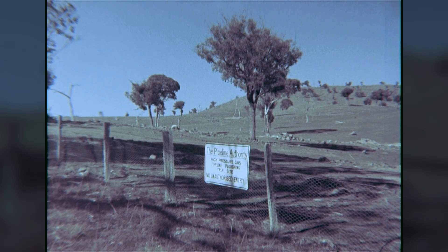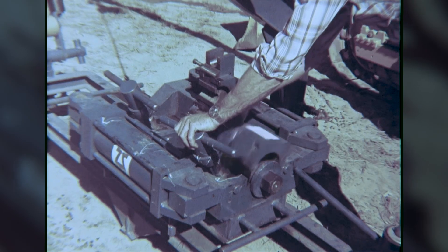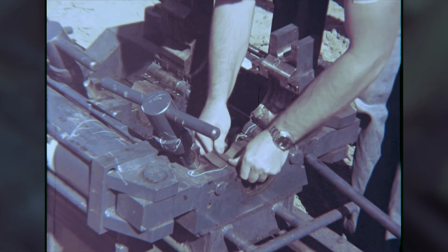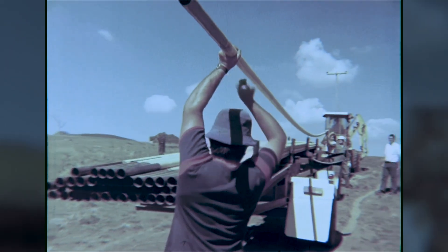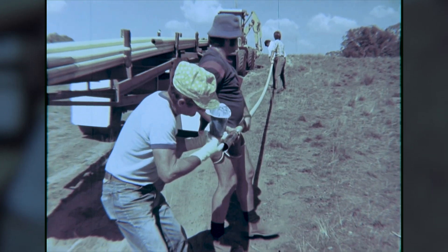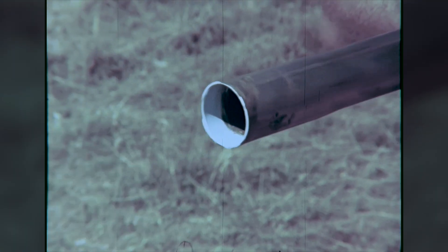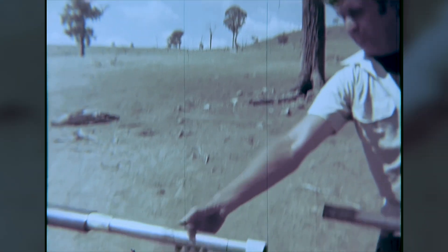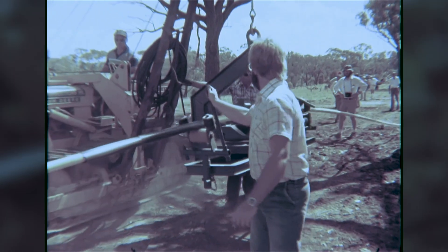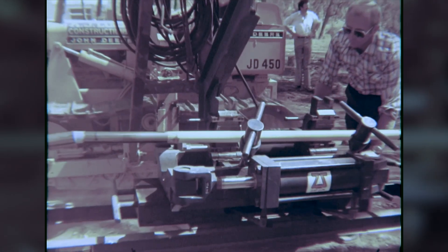The trials of the method were extended to construction of a kilometre of small diameter pipeline to allow full assessment of the method in field use. The mandrel is now replaced with clamping dies to allow the machine to be used to assemble the pipeline. Pipes were taken from a trailer, the sealant was applied, and then the ends were pushed together. The method proved to be very rapid. The kilometre took only three quarters of an hour, with the crew of five averaging more than a joint per minute.